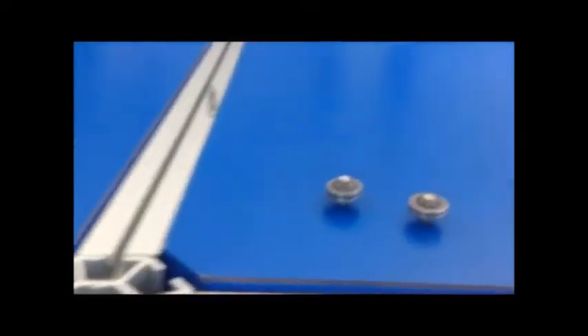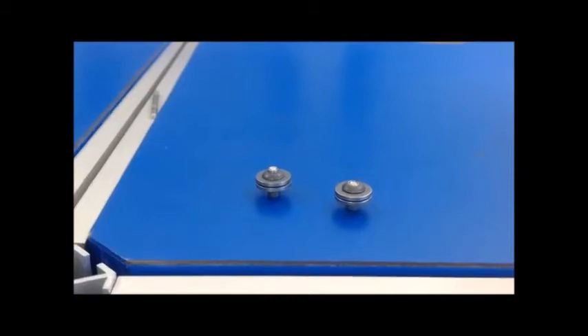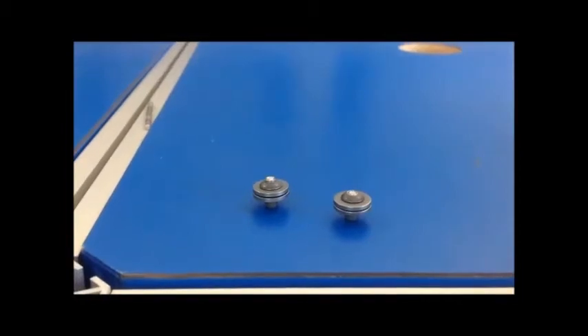Let's take a look at these two. After adjusting the inner anvil, we are able to break the ring and the pin tail flush with the head of the fastener.